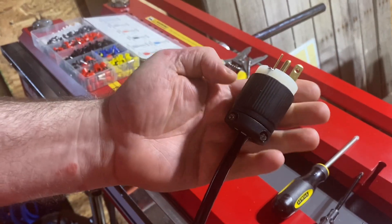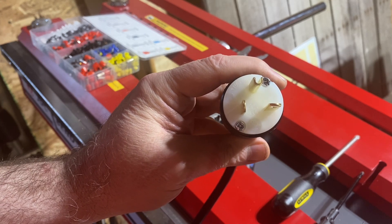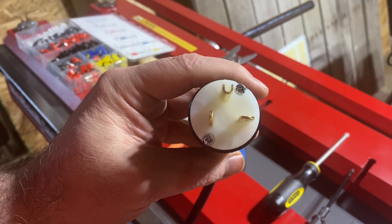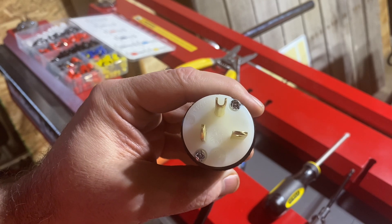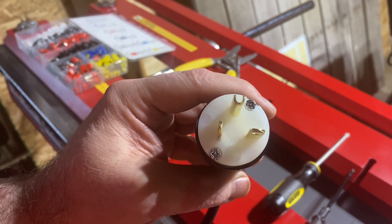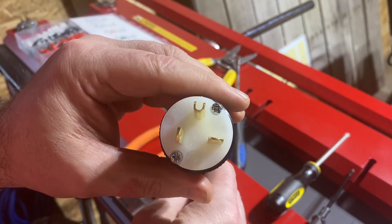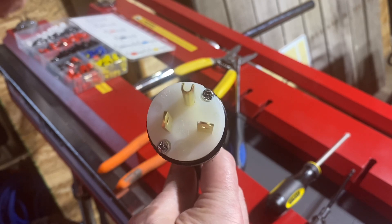Two more quick tips regarding the installation of this plug: there are different plugs and different outlet configurations for different voltages. This particular one with the grounding plug at one end and then a vertical and a sideways blade — that is single phase 220. It's impossible for this plug to be inserted into a 110 socket. Each different configuration of electrical application has its own designated plug and outlet, so if you've ever seen a crazy looking plug and wondered why, it's because it signifies a different application. Check the charts and install the right wiring.